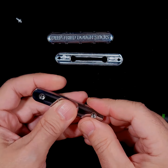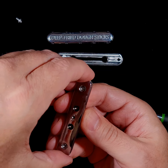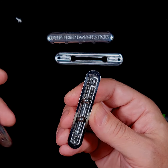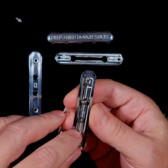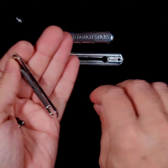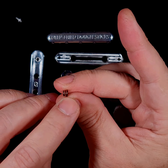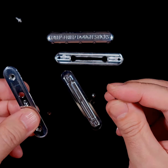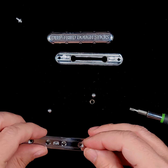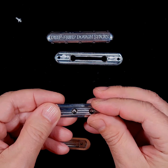Okay, it's already lifting off just a little bit. Try to be a little bit careful about this. Nice machining — look at those little machine lines. So there it is: two little springs and two little balls. You would probably not put it together in that order. Let's put it back together now. These are conical springs — one side is a little smaller diameter than the other side. We'll drop the balls back into this plate, and I'll put the smaller diameter end of the spring in head first. That seems to make the most sense.